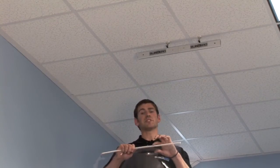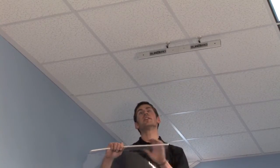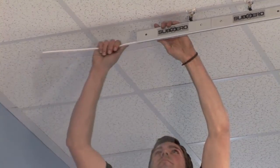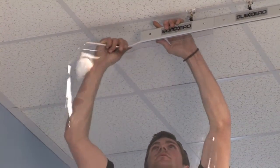Our next step will be installing our vinyl drop-down. Simply take the vinyl header and insert it into the aluminum lower groove by pushing it in. Now continue to repeat these three steps until our Rack Hat containment is complete.